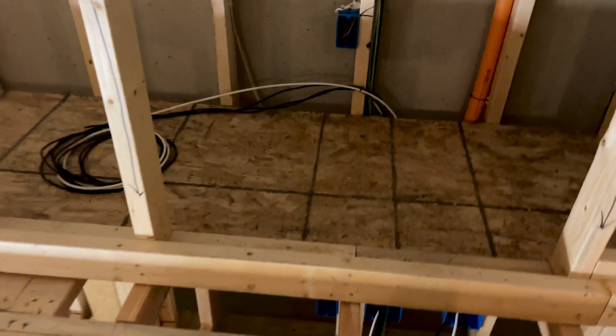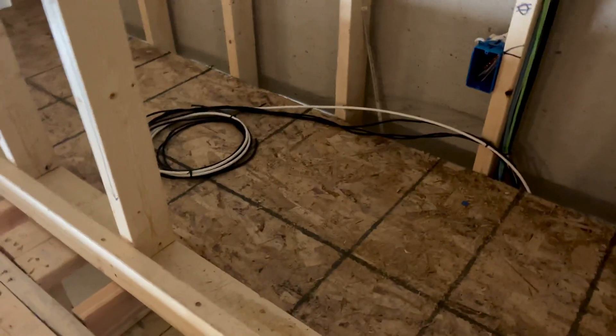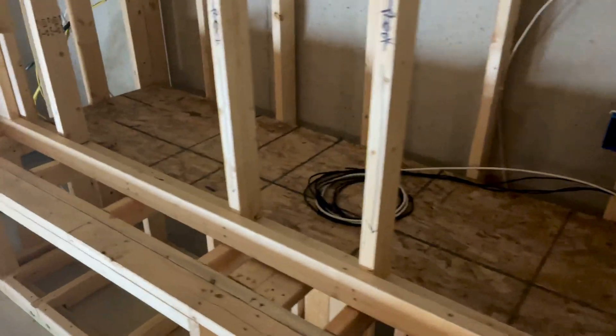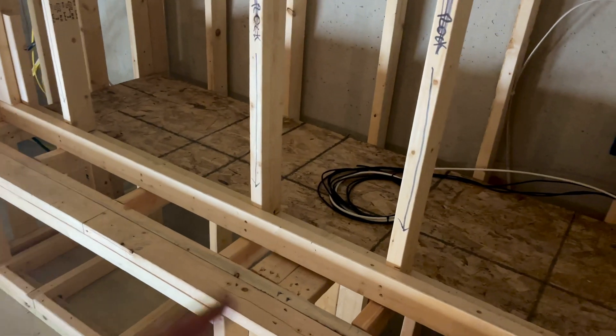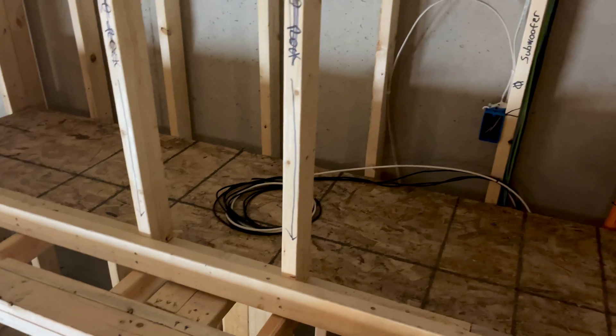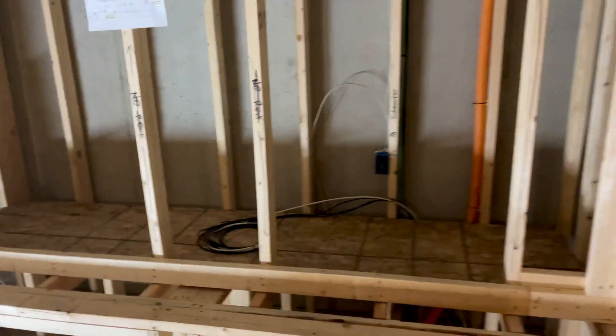In the front we're going to do a 110-inch acoustic screen. You can see the conduits coming from the projector — everything is going to mount back on the platform. The subwoofer gets plugged in there. Wiring for the front speakers: we're going with Klipsch — specifically the 8000 front tower speakers, left and right, subwoofer in the middle, and center speaker above that. It'll all be behind the acoustic screen, and if we ever need to get to it we just remove the screen from the wall.